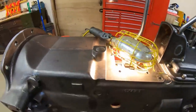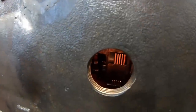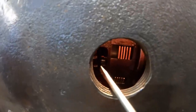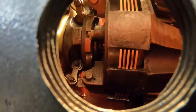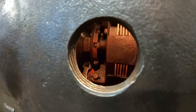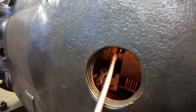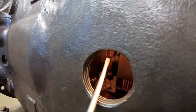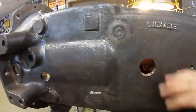This is another interesting prototype detail with X231. It's got this large threaded hole right on the side of the transmission housing, and that is your provision for going in and adjusting that over-center clutch. We'll spin it around to where we can see the adjusting pin. You'd take a long screwdriver, depress the pin, and then take another screwdriver or a thin pry bar and turn on the spider ring until that pin popped into the next notch. And that is how you would adjust that over-center clutch.